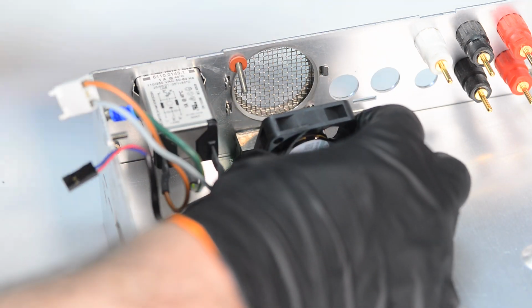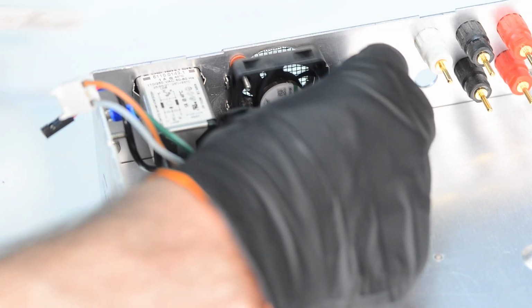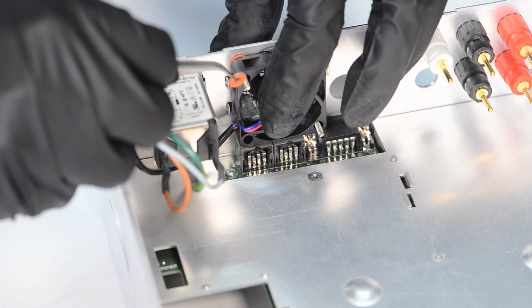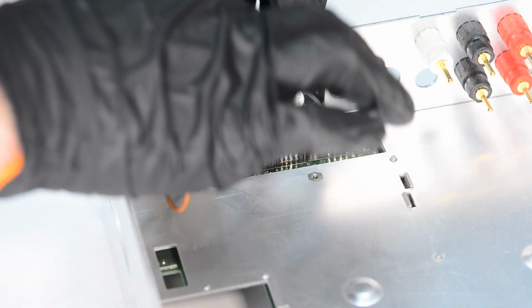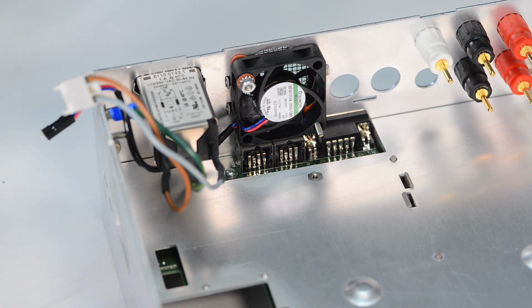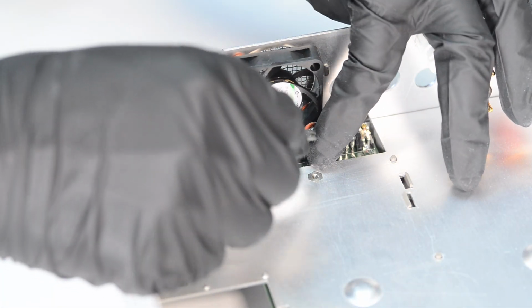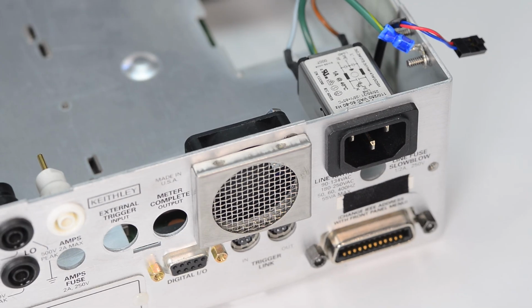It is easier to install the fan if you remove the filter holder, that is the mesh with the metal bracket around the back. So I'll do that in a second, after a failed attempt to add all the nuts and screws without removing the filter. It's just held by 2 clips on the side, so just pry it with the screwdriver and it goes right off.